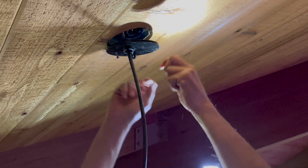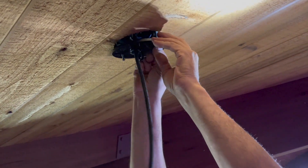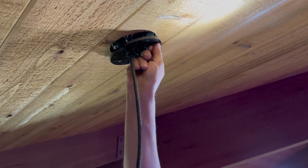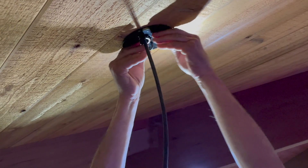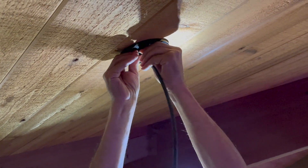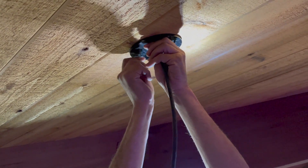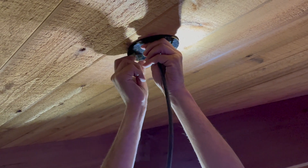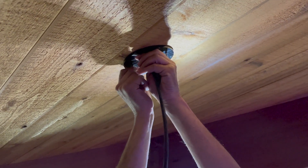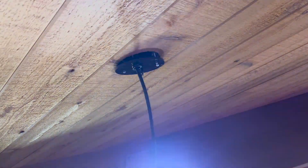We made up our electrical already. Got some SOJ cable going into the strain relief. We're using a 16-3 here, which I only recommend if you're going one-to-one to a circuit junction box. Do not use 16-3 if you're jumping from one light to another — use at least a 14-gauge grounded wire if you're using the included power con for jumping from one fixture to another.